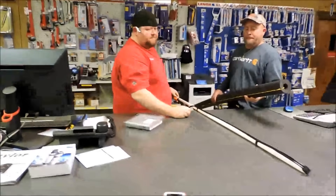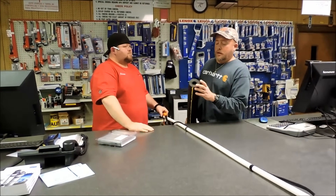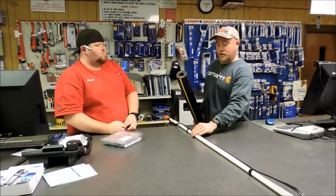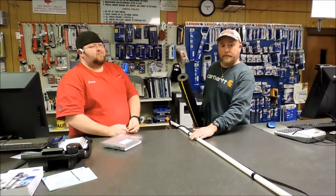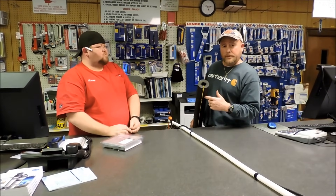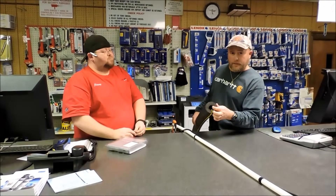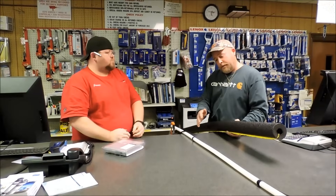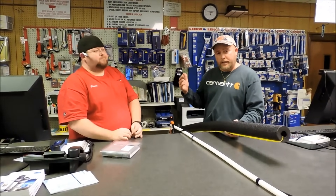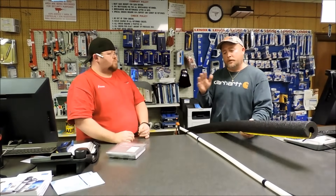What you're going to want to do is come see us because we're going to have this insulation in stock. This is three-quarter. This is made to fit one-inch copper because you've got three-quarter PEX plus the heat tape, which is going to make it bigger than seven-eighths. So you're going to need to get a little bit bigger insulation like we have here. We also sell it half-inch thick wall thickness and one-inch wall thickness. I suggest one-inch wall thickness — this thick insulation right here.